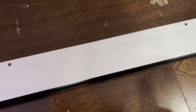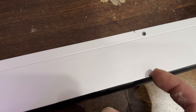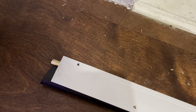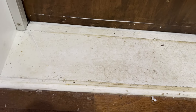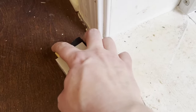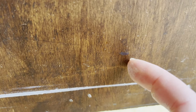It says to leave a sixteenth of an inch on each side, and I'm trying to understand how that works while still keeping a continuous seal on both sides. It's going to be tight but I think it'll be good — it'll fit right in the bottom there. This is the spring here that gets pushed in and drops the seal, and this can be adjusted once you have it on the door to get the right amount of drop. Since I don't have much to fill, I'm going to set it at the optimum of three-eighths of an inch from the bottom of the door, and it'll drop down that optimum amount.